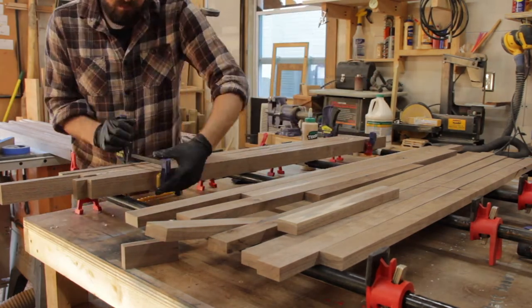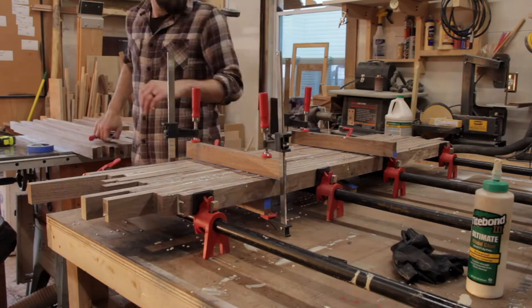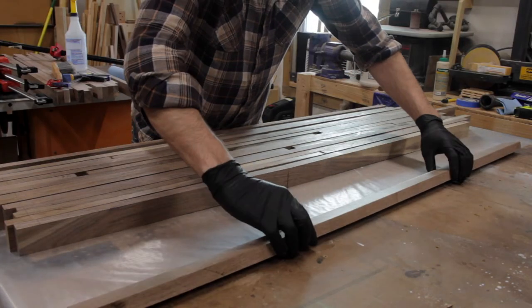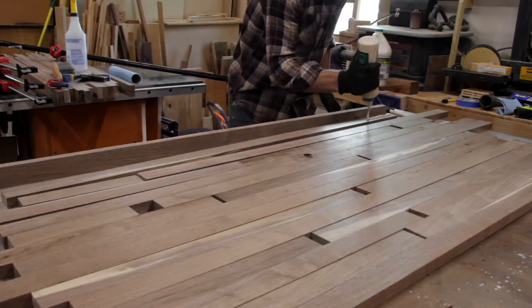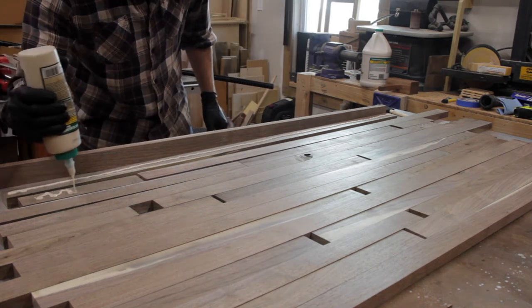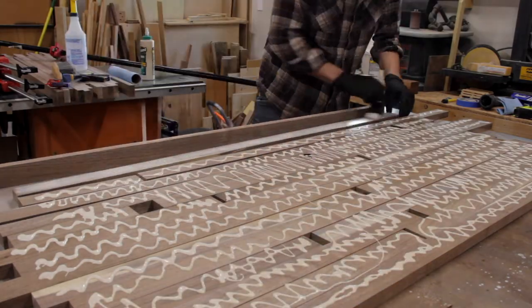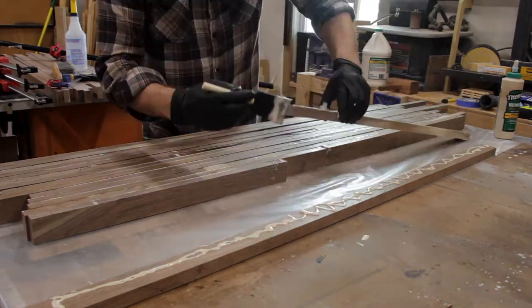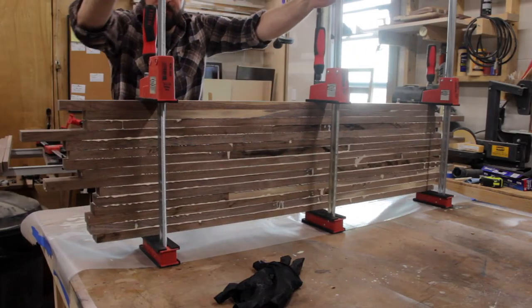Pro tip with lessons learned in real time. After struggling through the first glue up with the small pieces falling between the clamps, I tried something new. I put some wax paper down so the board wouldn't stick to my assembly table and glued everything up using the tabletop surface as the flat reference instead of the clamps. This made a huge difference. Also, using a bigger brush to spread the glue out made the glue up go a lot quicker. I've also learned that the best way to retain new information is to explain it to someone else, so all of these tips are really just for me.